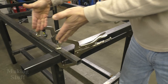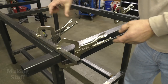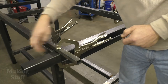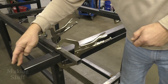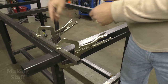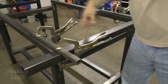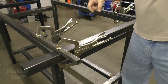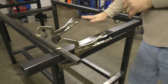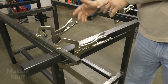And the gantry needs to go a little bit further back than the back of the table because the torch is mounted on the front and that gantry's got some thickness. So I left about 6 inches hanging off the end here. And that's going to give that some clearance so that I can reach the end of the table and get the full use of the CNC machine. Now, the water pan is going to sit down in here and the piece that's being cut is actually going to sit on the slats of the water pan.